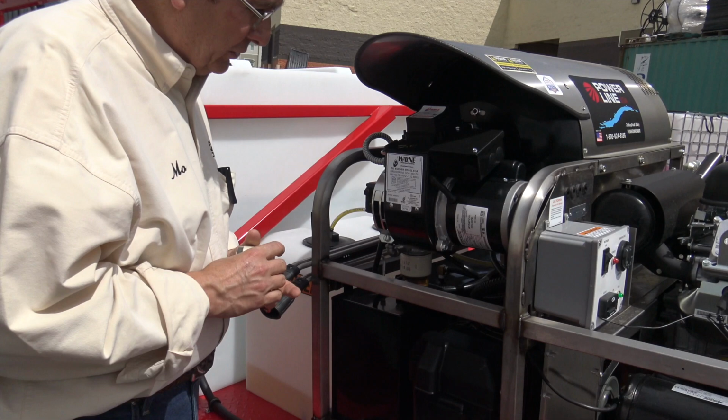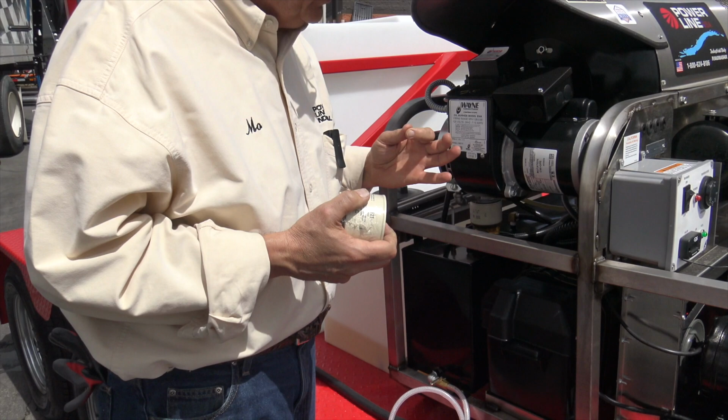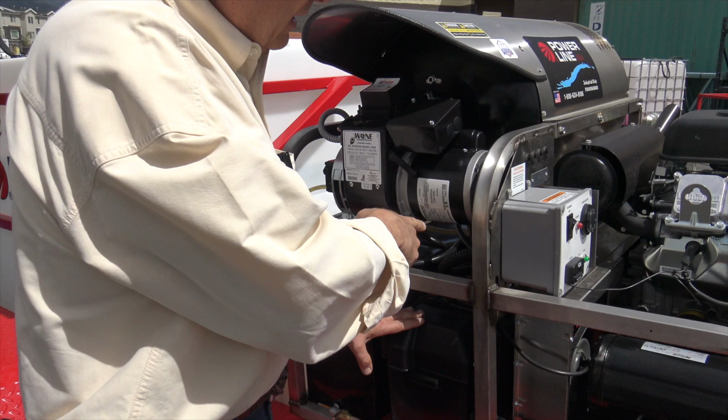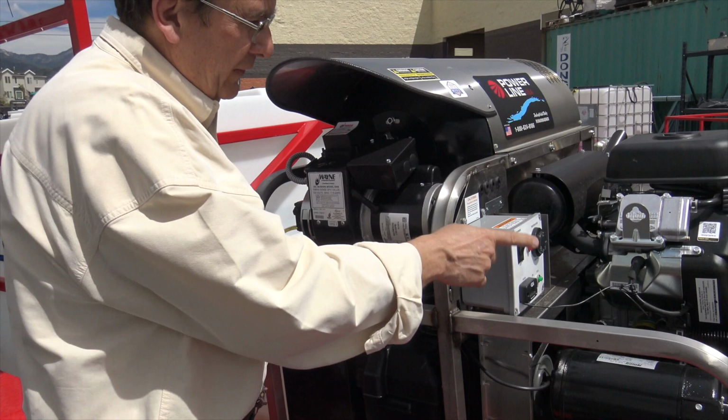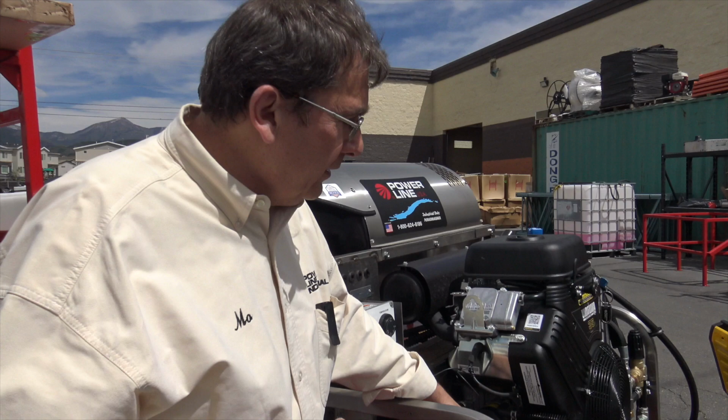While I'm looking at it, the battery's right here. We do put a deep cycle premium battery in here, but you got to keep it charged in between usages if you're not going to use it on a continuous basis. One of the advantages to the 115 volt system is this battery is charging off of the motor. The battery's just to crank the engine, where the 115 volt keeps the burner up. That's why you don't turn the burner on when you start it. You want to rev the engine up so you've got additional watts coming out of the 2000 watt generator here, okay?